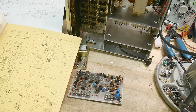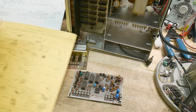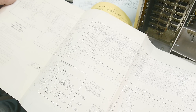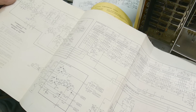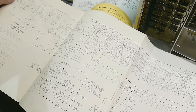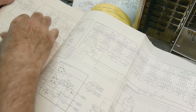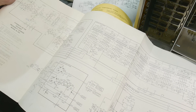The schematics are all on one page. So there's an input that goes into a FET, then into a differential amplifier, and those two signals do a kind of flip-flop thing, then feed into a counter and stuff.